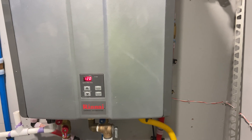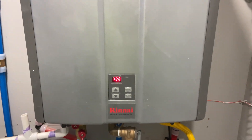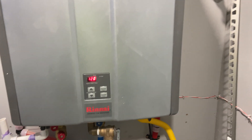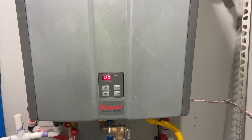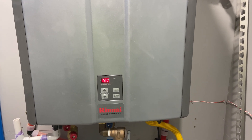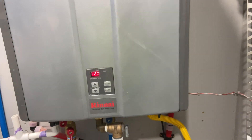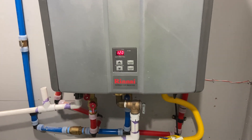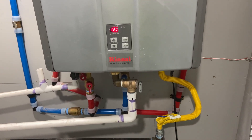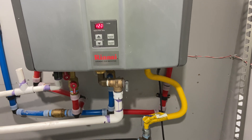So if you watched the previous video, you saw that we had issues. The thing was leaking from the factory — those screws were missing. I got those screws within two days and they fixed the problem. Putting those screws in, tightened everything up, and it held pressure, held water, and we're up and running. It went pretty textbook following the instructions. The only issue I had was an error code early on, mainly because I forgot to bleed the propane line so it couldn't ignite. Once I pulled the hose off and did that and reattached it, it was fine.